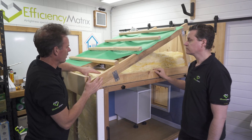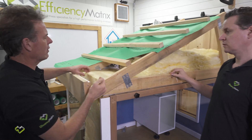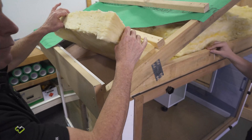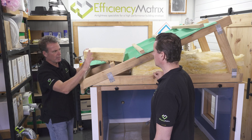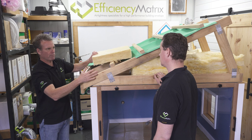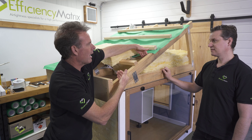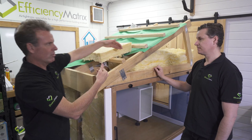What they've been doing is introducing what they call a perimeter bat — you stop your big bat back off the external wall and infill to the external wall with a 70 or 90 millimetre bat. This is an R2 or R2.5 bat, so one minute you've got R5 or R6, then you've got R2 around the perimeter. It's a big area — the perimeter of your house could be 100 lineal metres, and all that area has substandard insulation. You are maintaining airflow, but it's substandard insulation.